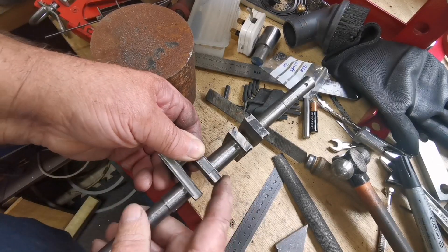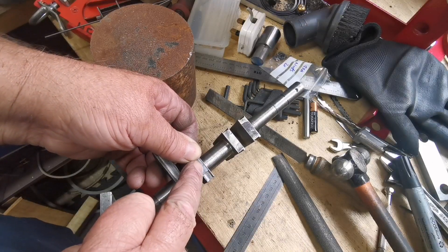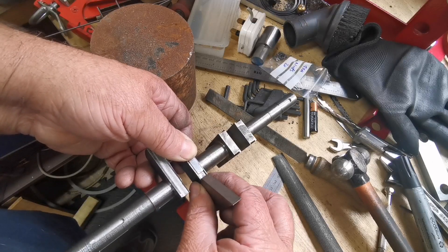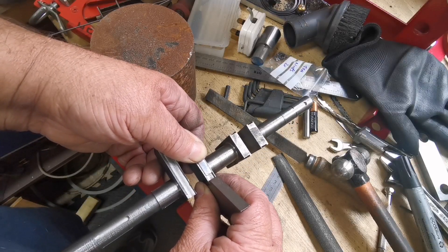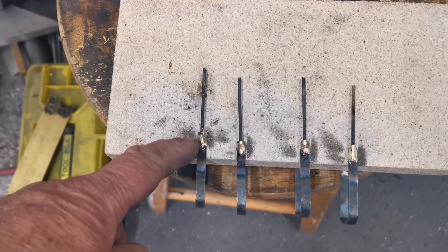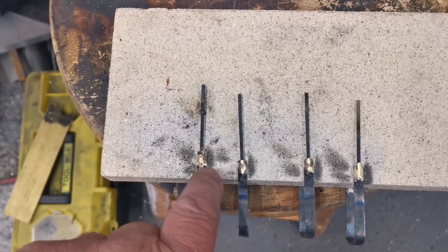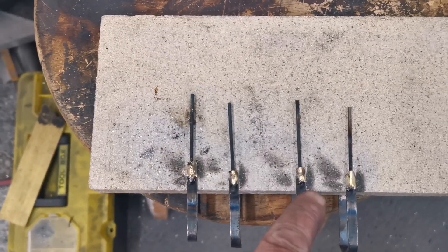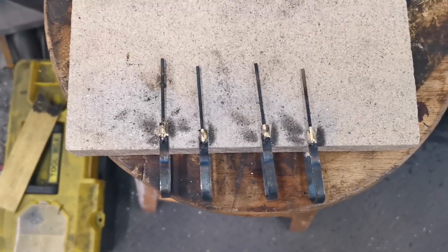Right, I've trimmed all my little straps. Next thing to do is cut some studding and weld them on to each side — long enough to go through the weight and long enough to get a nut on that side so we can do them up tight. Right, that's the studding brazed on to the little straps. What I did was use my MIG welder to put a little tack at the back there to stop the stud rolling around, and then I used my little torch and put a bit of brazing on — that's both sides.